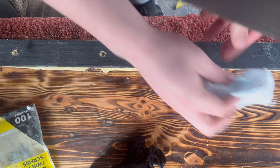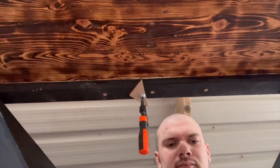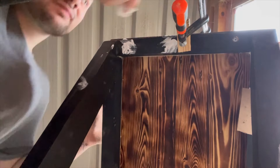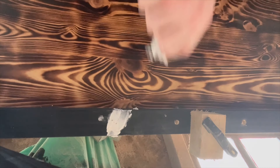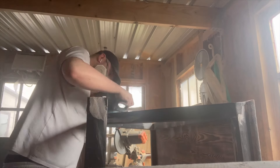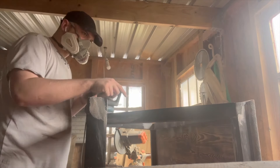I use a dry paper towel first, then go back with a wet cloth because the wet cloth gets rid of all the remaining glue — it's really easy to clean up. Then I use a bunch of clamps to really clamp it down because those screws basically did nothing since I drilled them too wide. But the table's strong and it's on there securely. Now I'm going around filling up all the last little bits of holes before starting the actual finishing sanding of the legs. In hindsight it would have been a lot easier to finish sanding the legs first and then attach them, but I scratched the hell out of the tabletop when I had to flip it over and do all the sanding, so I had to re-sand and re-finish the top. Another lesson learned.